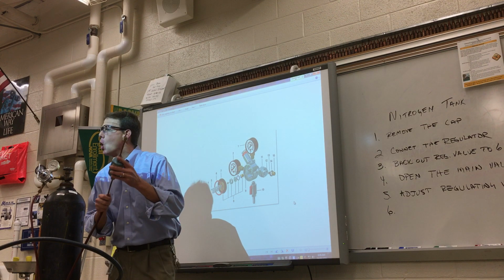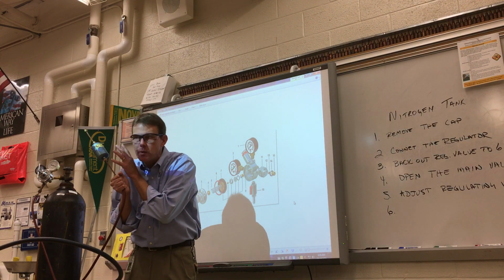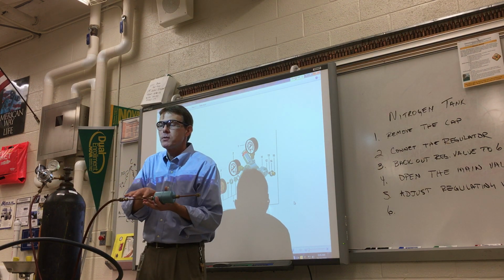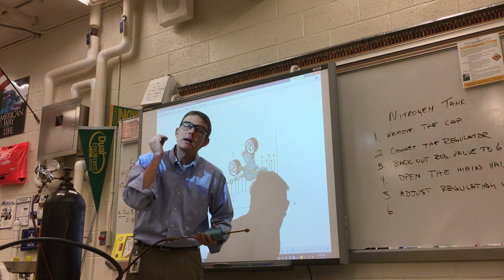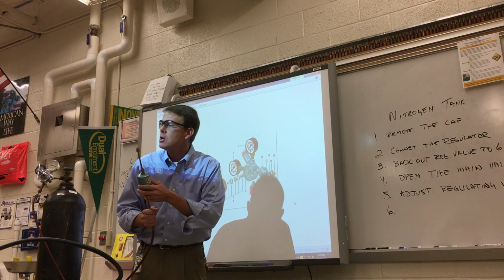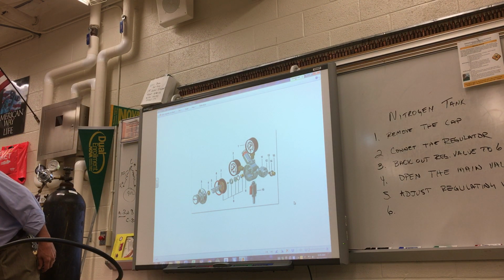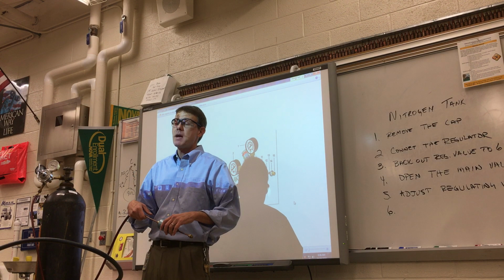Now look, don't put this stuff up to your face. Everybody wants to try and see if they can hear it with their ear. If the pressure blows out, or if something goes wrong with the flare nut, and all this pressure, 100 pounds, comes out next to your face, it can blow out your eardrum. It messes you up. For your project here, you're just going to stick it in a bucket. What do you hear? Bubbles, that's right. You got bubbles, that's a leak. That failed. That's bad. We can't have a leak.